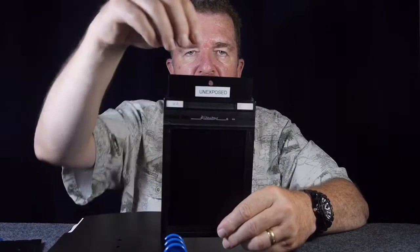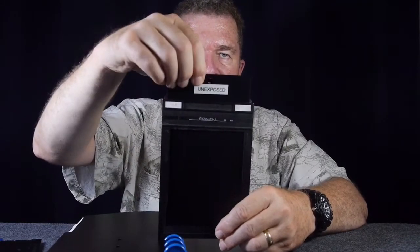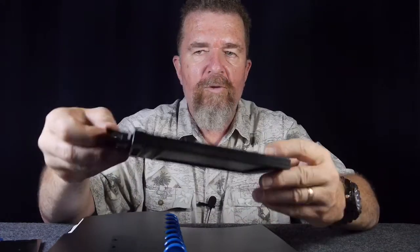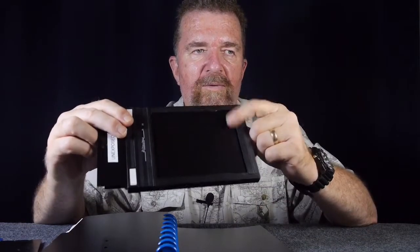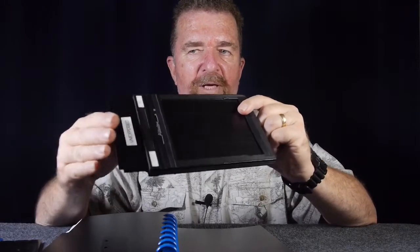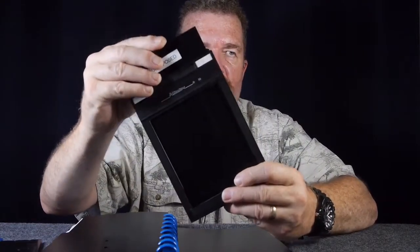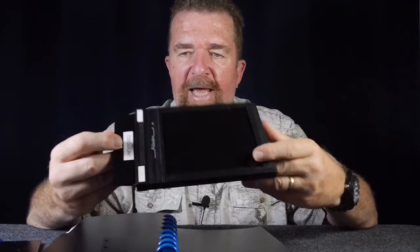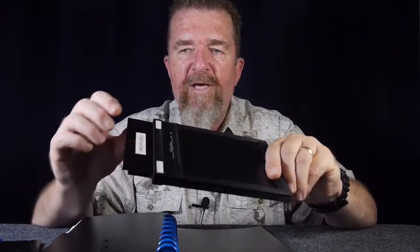You can tell when you're inserting them back in whether they're not in all the way. For instance, right there — I can tell it's not in all the way because it's not lined up with the other hole behind it. So it gives you a little bit of a safety indicator. You can tell if the part here isn't fully into the slot on the flap. Just make sure the film holder is firmly pushed against the camera in order to re-seat the holder. I haven't actually tested these, but I think for the project I'm going to use them for, they'll be sufficient. They are a little bit thinner than the original gauge, but the felt light traps in the film holder should be sufficient.